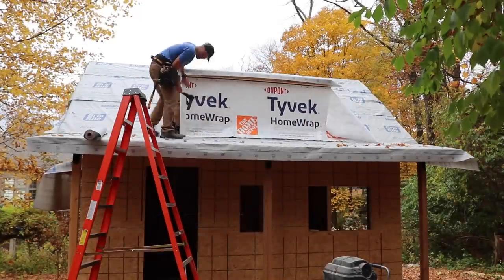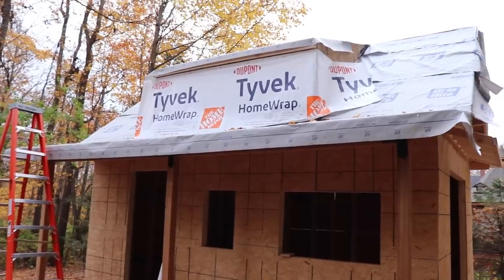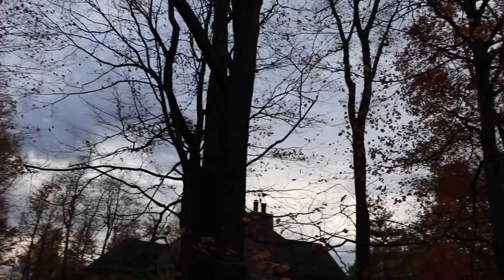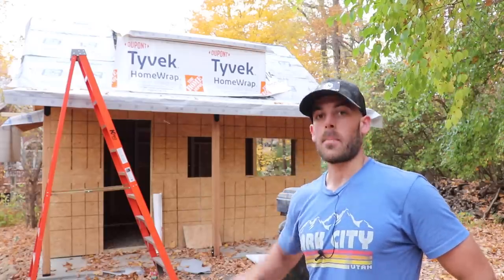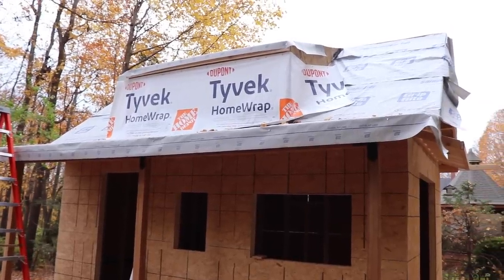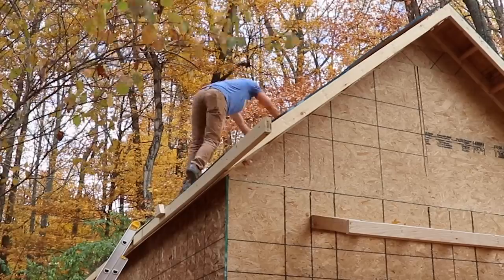After getting the roof covered, I started with the wrap on the top dormer — and then it dawned on me that I never went back and cut the window openings. Realizing my time was up, I threw in the towel. I tried leaving the edges of all the underlayment long to cover as much as possible ahead of the rain — that'll all get trimmed later. I didn't have time to nail the bottom edge of this underlayment, which might come back to bite me. It's starting to get dark — that's as waterproof as it's going to get before the rain hits. I got pretty much the whole roof covered except for one small strip on the back, and I ran out of flashing tape. The backside of the roof was an absolute nightmare — at just the incline where you start to slip — and I felt like I was going to die the entire time. One thing that helped was screwing in a two-by-four as a foothold to rest my foot against, which helped during both sheathing and the underlayment work.